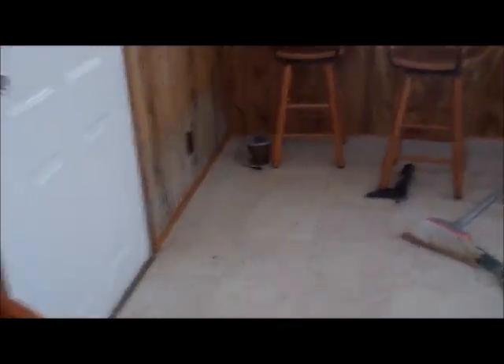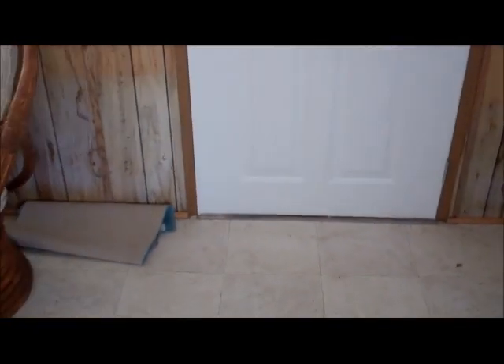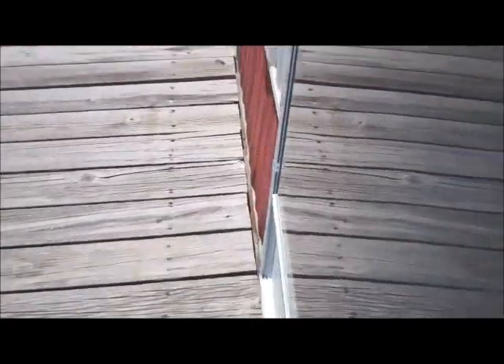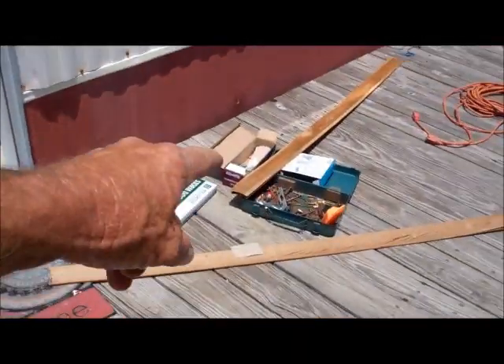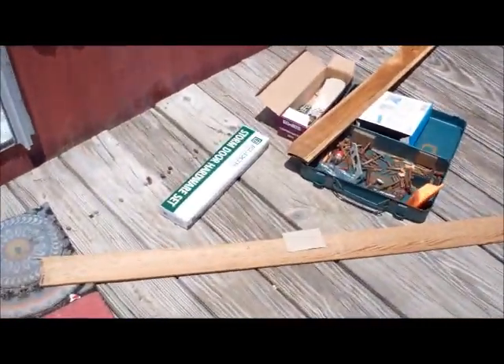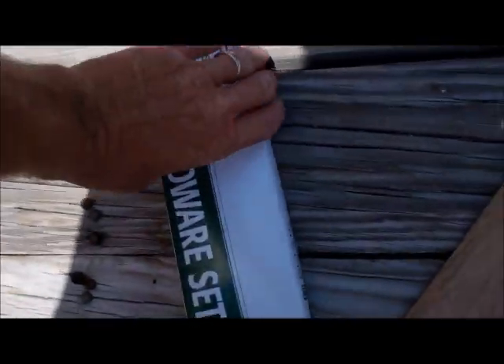So that's three doors. Cleaning up right now — there's one of my guys. We installed those piers underneath the floor up here, re-secured that when it was there and added another one, so that this door would operate without having to be beat up on the bottom or our drip plate being torn off of it — we don't like that. So getting ready to install our door spring accessories for the door — that's the next thing, installing the spring on the door, or the shock, storm door hardware. Here we go.